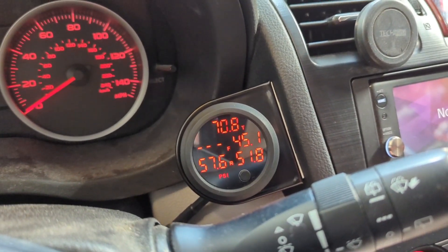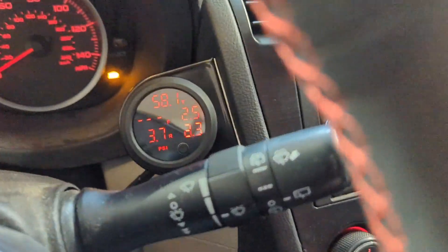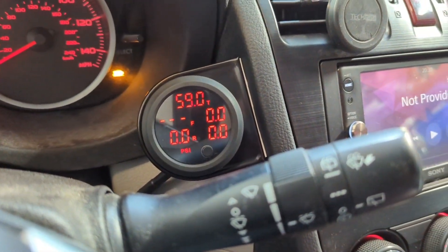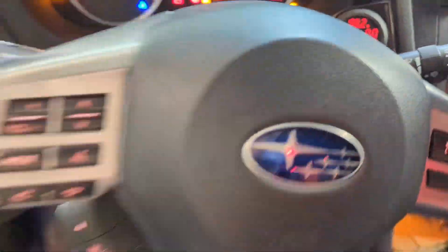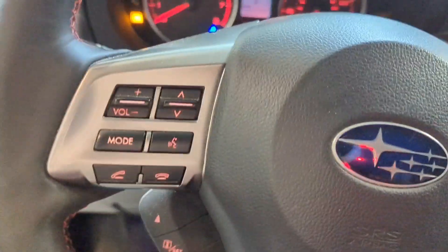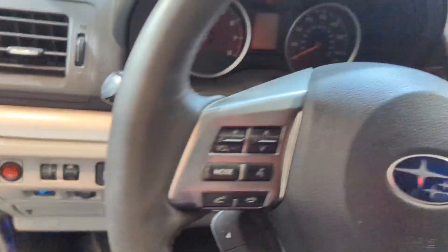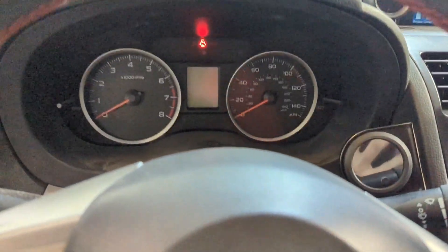Still got some oil pressure. I turned on the ignition but it was already armed, so it dropped from 70-plus down to 59 — but that's totally expected and how it's supposed to work. Ignition off. I'm going to rearm it for the next time I want to start the car, and then it'll be able to pre-oil the engine during that start. Thanks for watching.